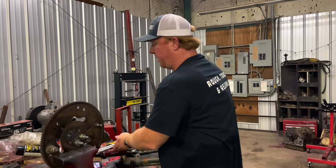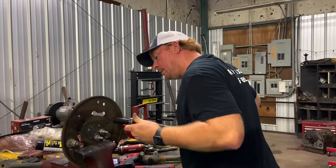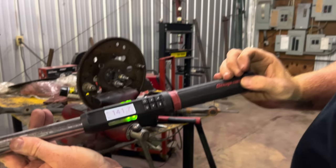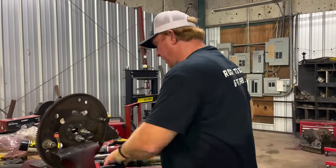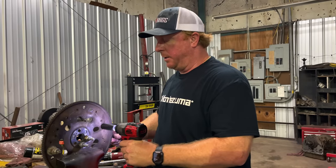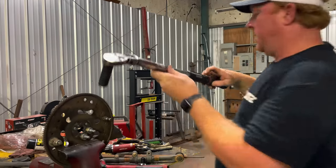Let's do 140. So now we're trying twice — double what Mac claims that it can do. They said 71 was the max claimed torque and we're at 140. The bolt's not hot, the socket's not hot, it's not having to work, it's not laboring to do it. Let's try 150, see what happens. I figure we'll strip the bolt out.